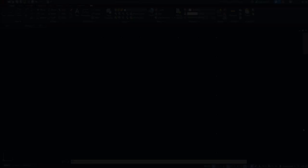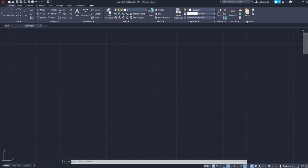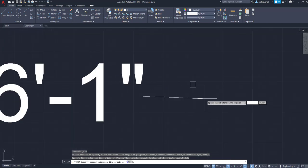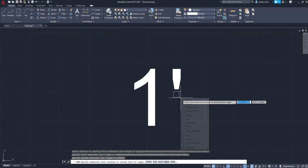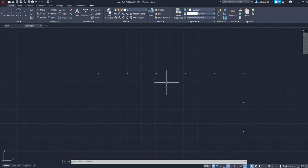For part one, we're going to be doing an inner wall. For the first little bit of this video, I actually did a little bit of pre-work — I created an outline of just two sides of the walls for the building column. Now every building or warehouse will have exposed building columns because the warehouse will not be able to support its roof through just its walls. We have the columns spaced out at roughly 54 feet from center to center, and the columns themselves are actually one foot by one foot, with 54 feet in between each column. The column will span throughout the entire building.